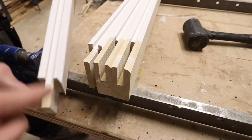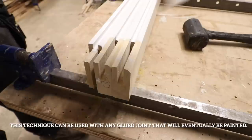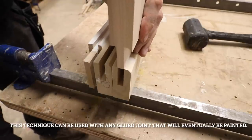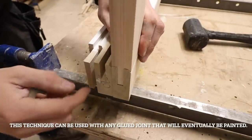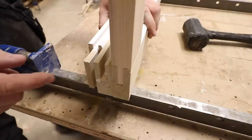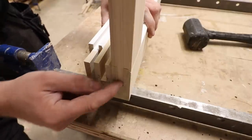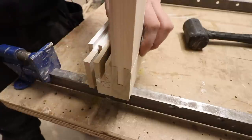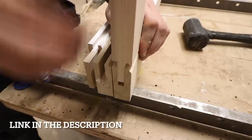This is the joint. I've got a little beveled scribe over the bevel on the rails. They just slot together so it's a blind tenon in a very standard cupboard door sort of joint, and I've set the bottom of this joint depth using the router bit that works really well for setting the bottom of the haunch depth. If you've not checked that video out, go have a look because that's another game-changing little tip for this type of joint.